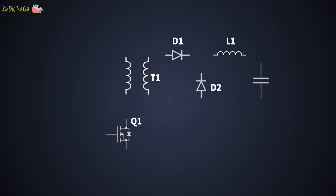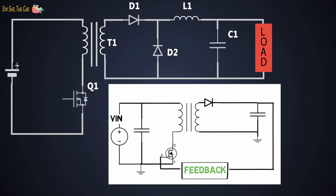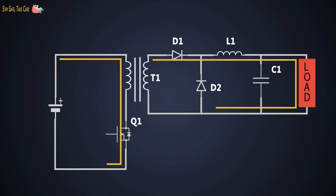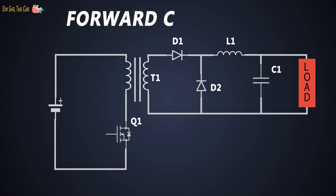The topology of the forward converter is slightly different than a flyback converter. The forward converter consists of a MOSFET, two diodes, a transformer, inductor and an output capacitor. There is a very important difference between flyback converter and a forward converter: in the flyback converter, when the current is flowing through the primary of the transformer, there is no current in the secondary side. Here it is exactly opposite — the primary and secondary current flow simultaneously through both windings. That's why the name of this converter is the forward converter.